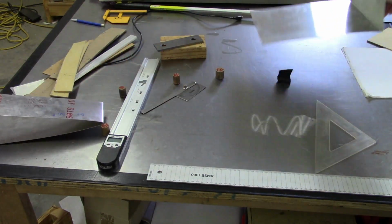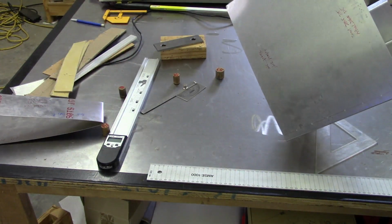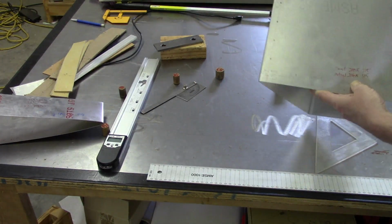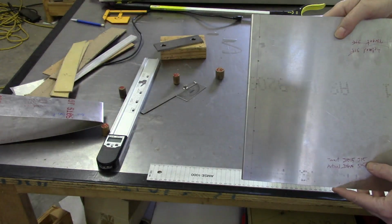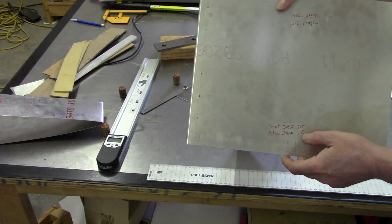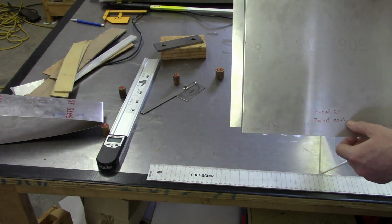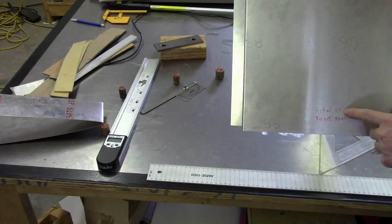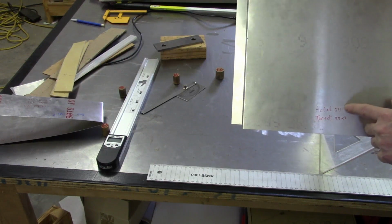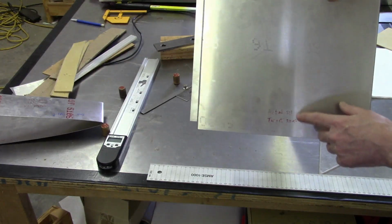So then we'll jump over to the aileron. Actually, the aileron did have a problem, but that was a problem in my drawing. So on this side here, get the side up. This side came out pretty good. Was shooting for 315 and actually got 315, so that's always good to see. This one did drift a little bit on me. 310 versus actual of 313, and I was shooting for around 310 to 311, so this came out maybe a few millimeters short.